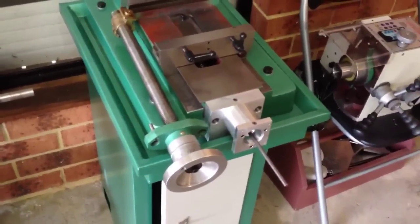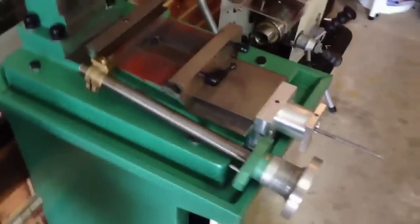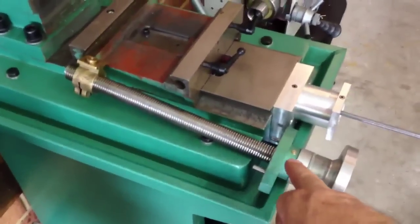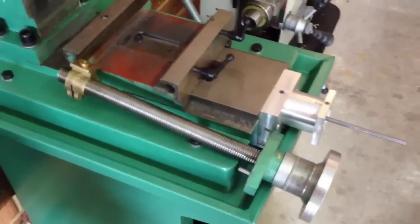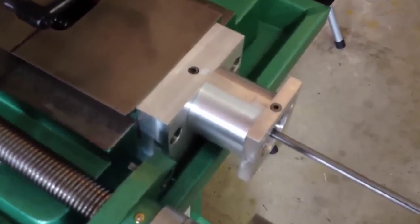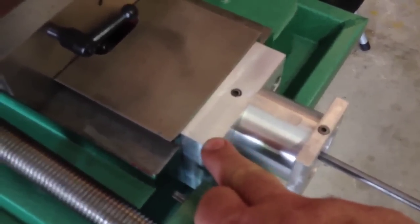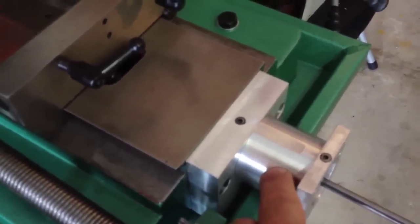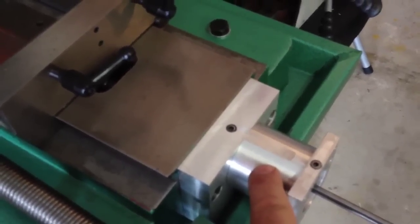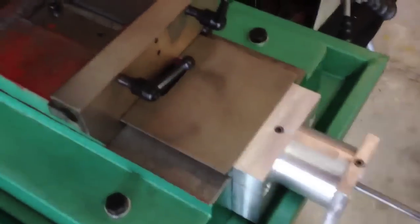Today I'm just going to show you how I converted my Y-axis. The first thing I had to do was actually pull off the old one and remove it, and take measurements from that to make the new part. It's quite simple what I've done — I've just put on an aluminium block, which I made at my workplace on the manual milling machine. I made this tube here as well on my little lathe at home, and also made this little square plate here.